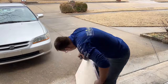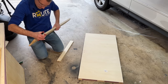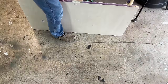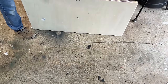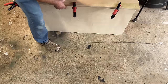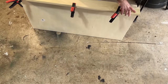Next I worked on attaching the sides to the layout base. I used half-inch thick poplar boards that were 6 inches wide and 48 inches long for the layout sides, but 1x6 clear pine would work just as well. I clamped a 1x3 along one edge to act as a temporary spacer, then applied a layer of wood glue to the edge of one side of the layout base. Using my brad nailer, I put a few brads into each of the wood blocks in the layout base to hold everything secure while the glue dried. You could just use wood screws in those same locations, but using screws just really isn't quite as fun as using a nail gun.